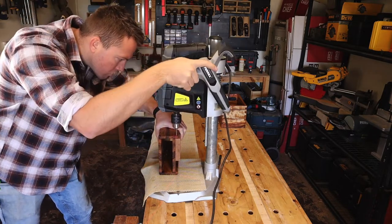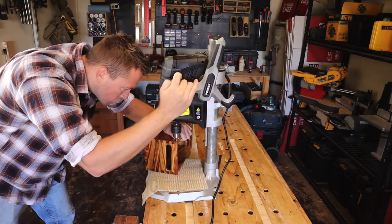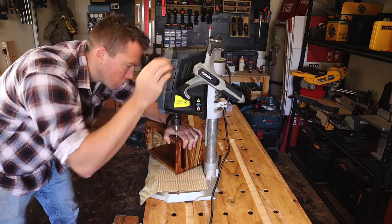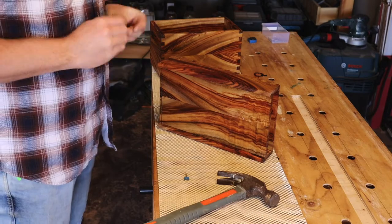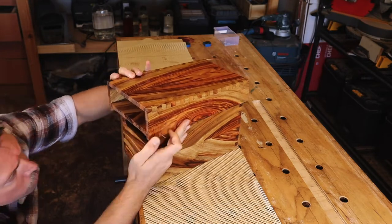For the lid pivot I measure and mark carefully then use a 2mm bit to drill with a backer to prevent blowout. I also made some simple washers out of this plastic shim. I'm knocking a small nail in until it's just through to the other side before positioning the lid into place and driving those nails home — and we're done.